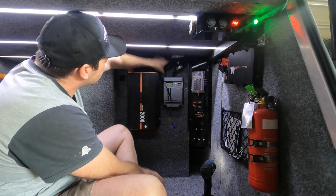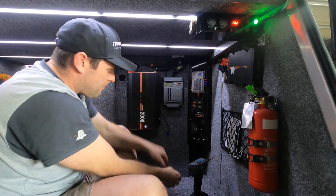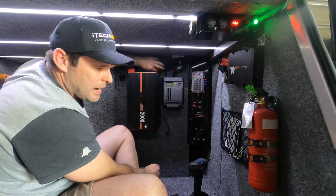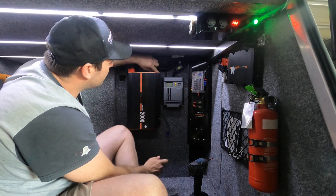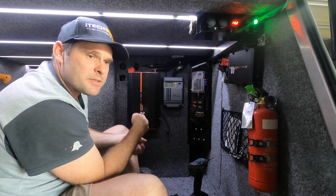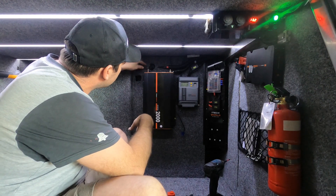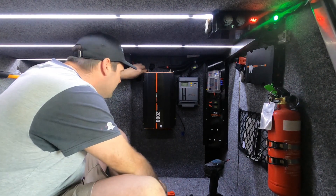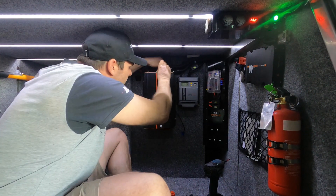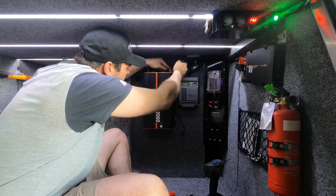Take your black cap off here — it's just a screw-on cap. I'm going to connect the negative first and then the positive. I'll make sure that the circuit breaker is open so it doesn't complete a circuit. Then it's just as simple as flicking the circuit breaker on. I've got my short cable here, I'm going to connect that to the inverter with a spring washer and nut, and nip these up firm — you don't want to over-tighten, just be firm with them.